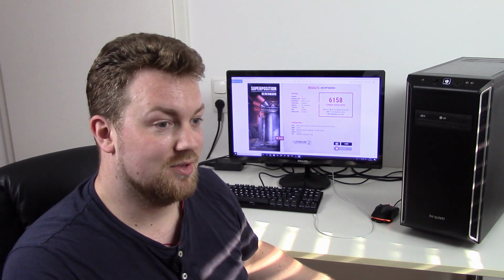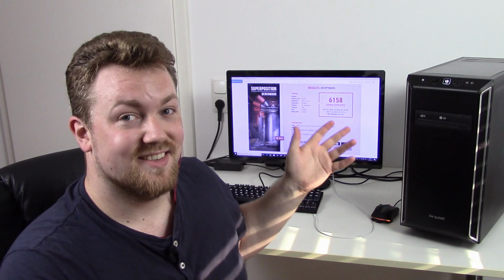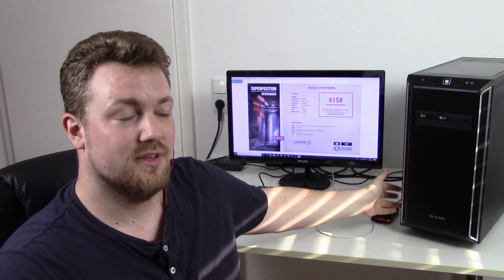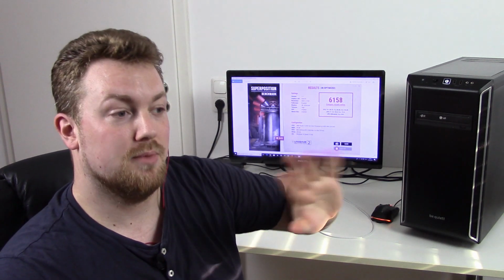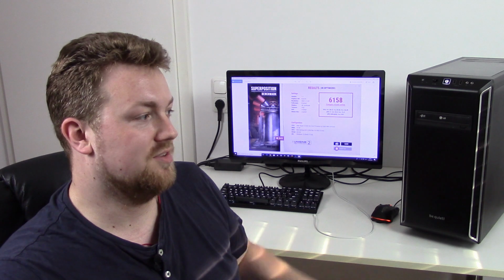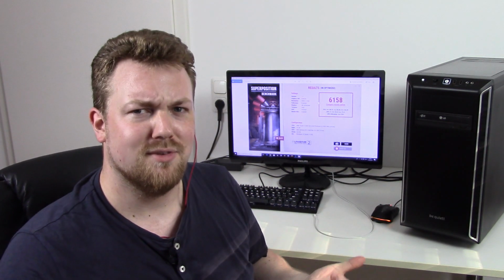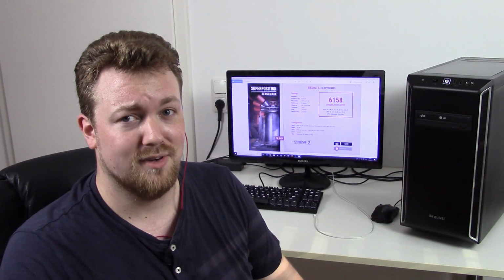And the reason for that was, after I checked the manual, always check the manual, that if you have an NVMe SSD, two of the SATA ports in the motherboard are actually being disconnected, so the PCIe lanes can be used for the NVMe SSD. So after a few minutes of looking back and forth and wondering why nothing's there, I just plugged it into another port and then everything worked fine.